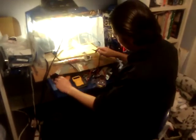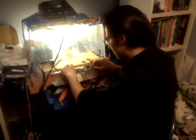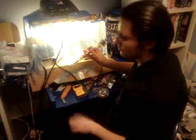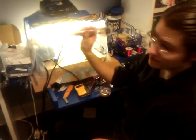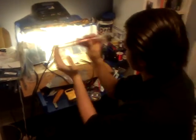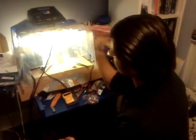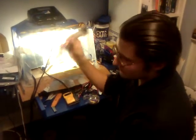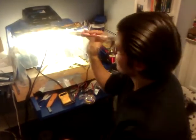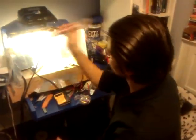So here is my shake flashlight. Right now I have these capacitors charged up to about 1.5 volts, just basically to cheat so I don't have to sit here shaking for 15 minutes. But I can shake it and pretty soon the light will start to light up. It takes a little while because these are big capacitors — I have about 5 farads of capacitors on here for just a little over 5 volts.